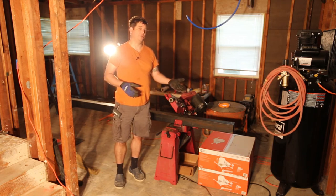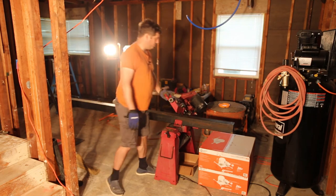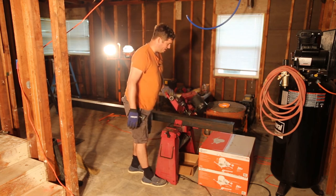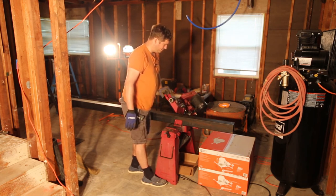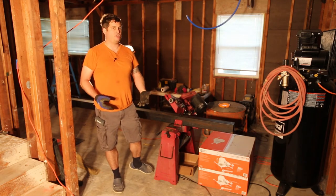I did use smaller pieces for the cord wraps and then I painted the cart with Rust-Oleum paint. I'm going to go ahead and start the cut — I always lower the blade gently onto the piece. If you were to drop it, you would shock the blade, and anytime you shock or stress the blade you increase the odds of breaking it.